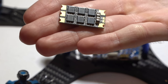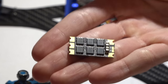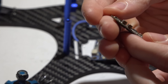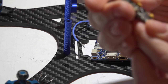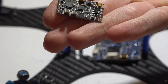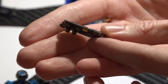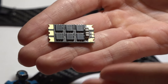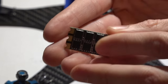That's the great thing about T-motor - super high quality. The ESCs I chose are the 30 amp Super Racer BLHeli-S V2 with the Dshot ready option, meaning the cap has already been removed and the firmware flashed. These also apparently have LEDs built in, which I plan on turning off. They're rated from 2 to 6S LiPo with a 40 amp burst rating for 10 seconds. I have never used this ESC before so I don't know if they're bad or good - we'll find out.